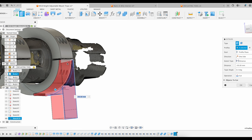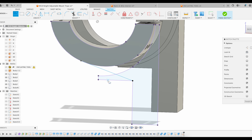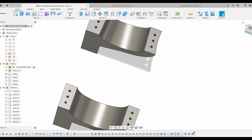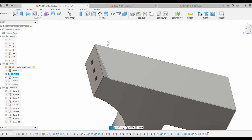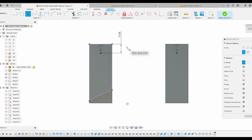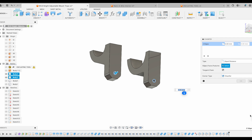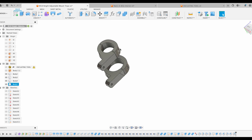Now I needed to create the feature that would actually give me the ability to mount it to the table. Once I did one side, I just did a project to the other side with a few little modifications to get it to work. Extruded that and then combined those solids to the other half of the clamp. I did a little bit of cleanup by adding some fillets before creating the holes that would allow this to mount to the table - a couple of large holes for the M6 bolts used to mount this to the actual table, then cleaned it up with some more chamfers and fillets.